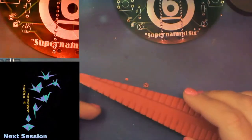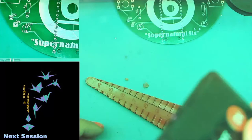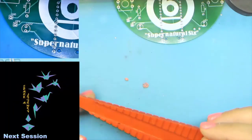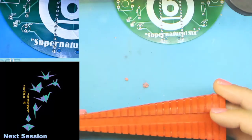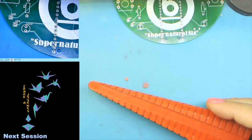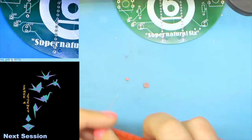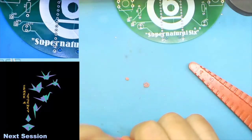There we go. All right, so first up, we got a resistor bender. This one I actually inherited. It's in Radio Shack Red to give you some idea of how old it is. You can 3D print these. You can find them online. Basically, the idea is that you get the nice, perfect U for your resistors, like so. And then that'll slide into the board much easier.